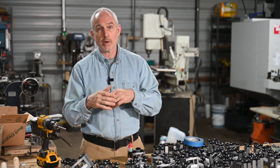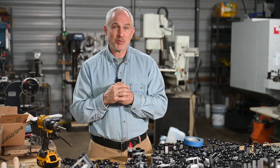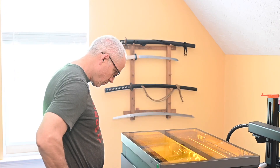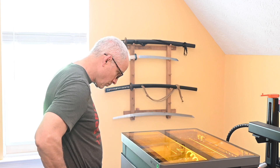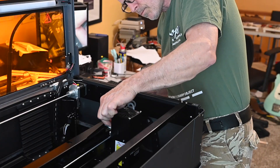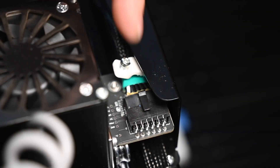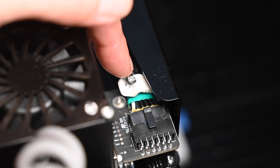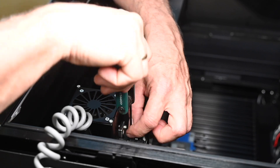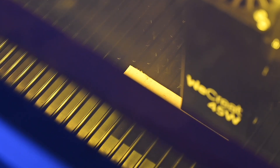This is one critical limitation of diode lasers — they are limited in what materials they can mark. Steel, stainless, carbon, tool steel? All of the above. You want to engrave leather or kydex for sheaths? Great for that absolutely. How about non-ferrous metals like copper, brass, aluminum? That's where this little infrared laser unit comes in. With this one unit you can now work with non-ferrous metals, allowing you to add engraving to brass fittings, aluminum parts, whatever. One qualification — while this is a swappable part, there are some very tiny multi-pin connectors and a wire harness that have to be unplugged and replugged to mount the unit. I found them uncooperative enough to change that I wouldn't be swapping this unit in and out on the regular. So for me, this is a wood, plastic, and steel unit.